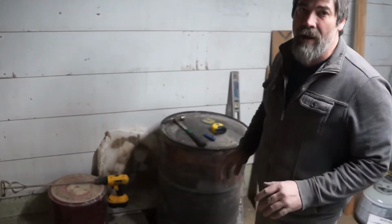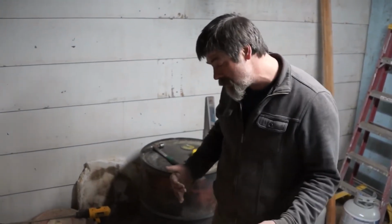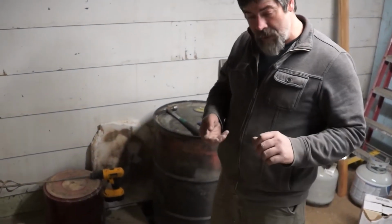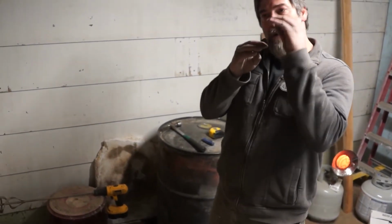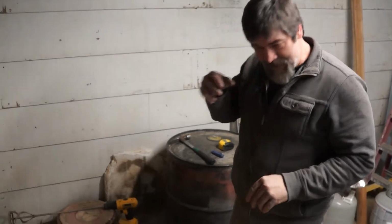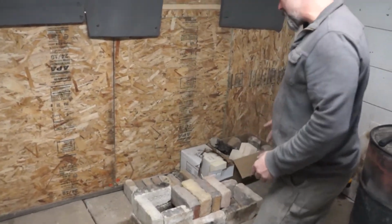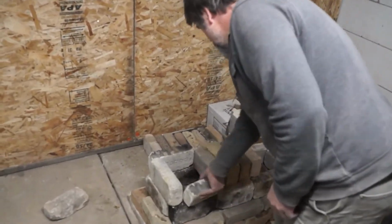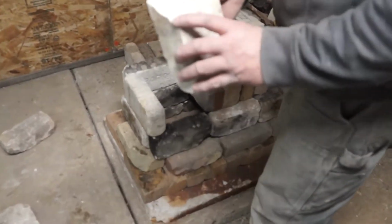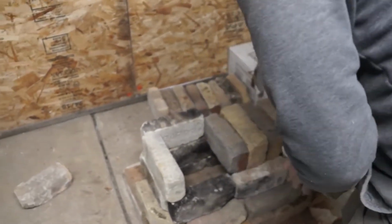Every time I do the layout, I'm just a little bit more careful. I take my time over it. I go a little bit more slowly every time. I eliminate bricks that are a little thick or a little thin if I can when they're laying next to each other. You know, we're dealing with recycled stuff. And here's something to think about with the feed, right? This one is a busted piece, so I'm going to eliminate this piece later. I'll replace it with a cut piece. But it's my stand-in.